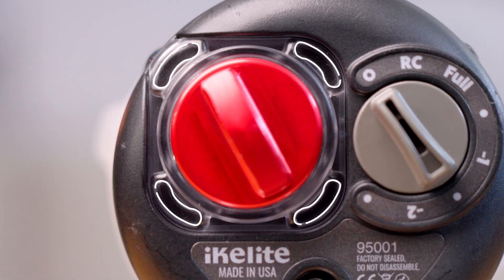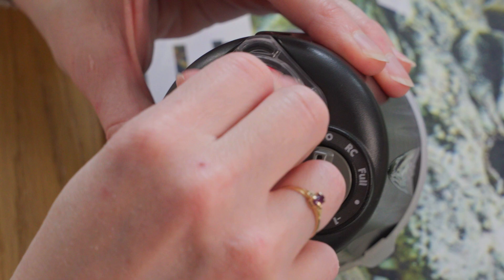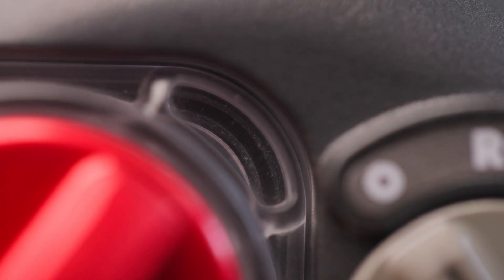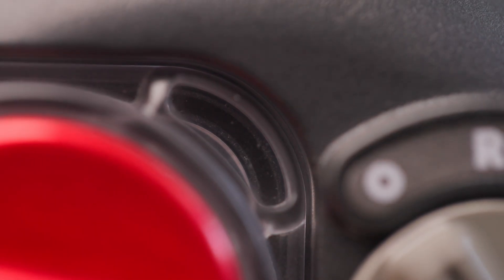Notice that there are four viewing windows in the door and you can see that the o-ring shows up as a very thin black line. I'm going to slowly turn the battery door thumbscrew clockwise just until that line starts to thicken. Practice this so that you know what it looks like. After it just starts to thicken, turn the thumbscrew another quarter turn. The o-ring seal will now show up as a thicker solid black line — that means that it's sealed. Do not turn the thumbscrew anymore.